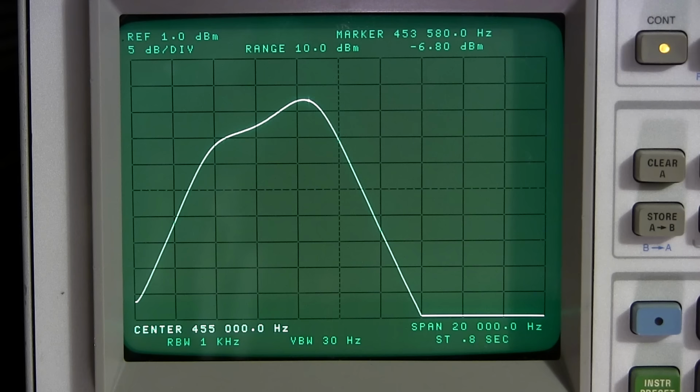To give you an example, if you were to tune into a radio station, when it appears to sound like it's right on frequency would be when you're at this point of the curve right here. As you're tuning the dial, you'd be coming closer and closer to this, and all of a sudden, it sounds like the radio station's right on frequency at around 453.400, something like that. Now, you might be saying to yourself, isn't it supposed to be at 455? That's the center. Well, in optimum conditions, say the crystal in the crystal selectivity box was cut exactly for 455 and everything is perfect, yeah, it would sit right in the center.